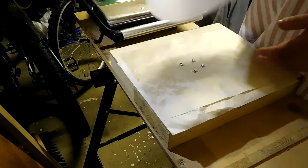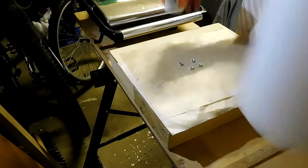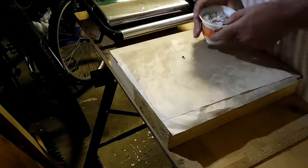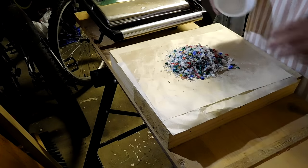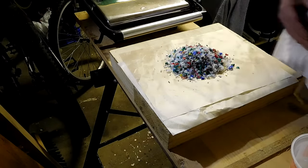The other thing I use is this cardboard ring. The reason I use it is that the plastic granules have a tendency to spread when they're poured on. If we're not careful, keeping it all in one place while it melts and sticks to the bottom is actually quite difficult - you can't heap up very much. I use a cardboard ring just to constrain it while it's melting.